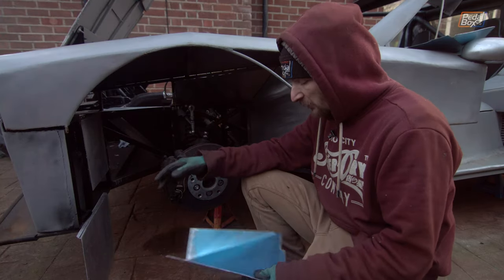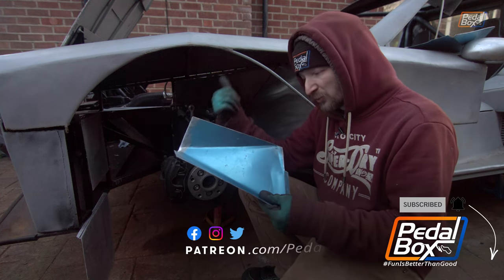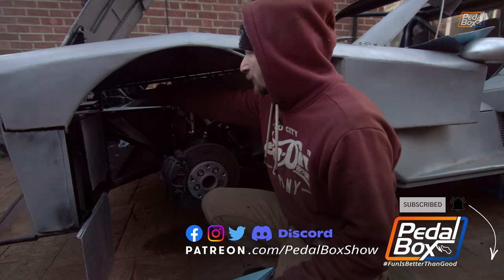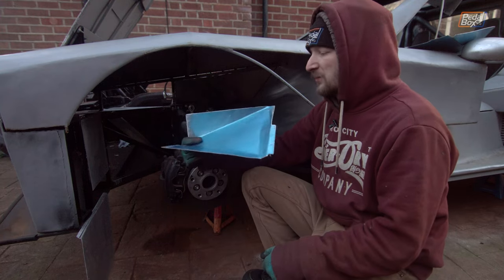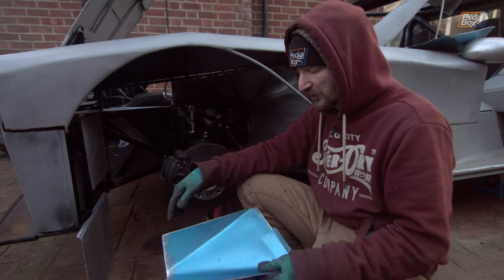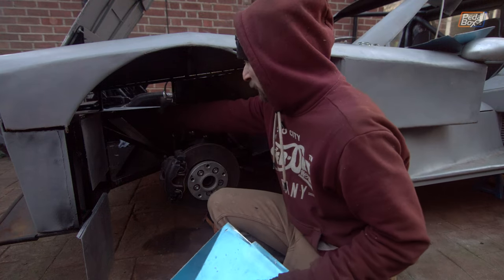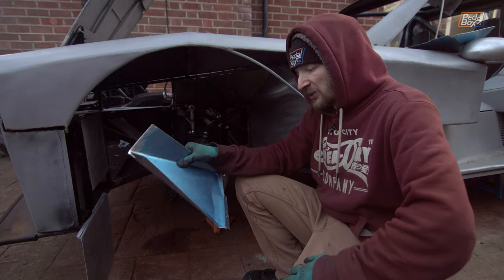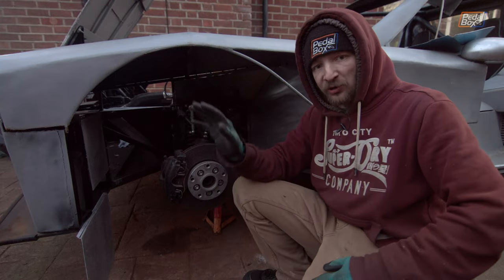While finishing up at the front of the car, we're going to do more work on the inner wheel arches. I've had a couple of panels like this — the driver's side one that we've been trying to make to fill in the gap just where the wheel arch joins into where the bonnet hinges go. This is a fairly complex piece with quite a few different bends to accommodate the geometry up there. The problem is it's still not complicated enough — there's even more bends needed to get around all the intricate bits around the corners, and we've basically decided this approach is doomed.